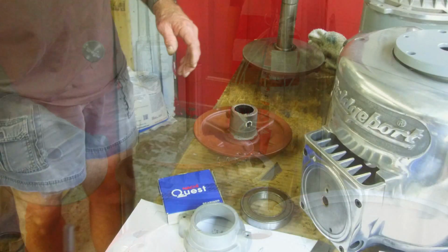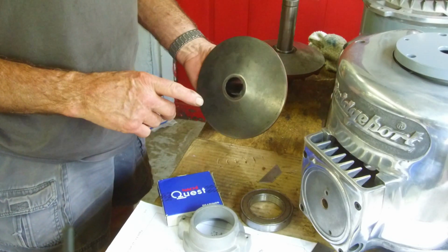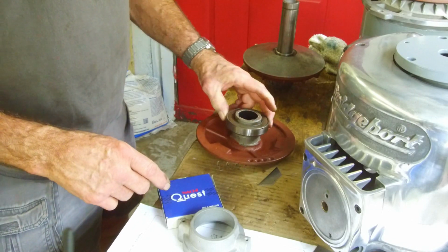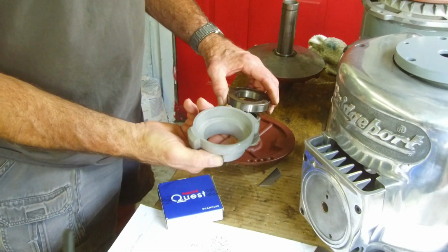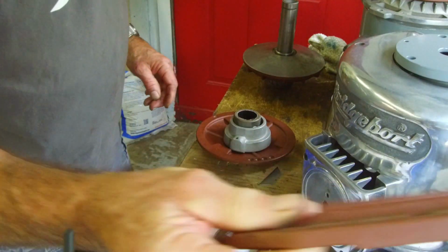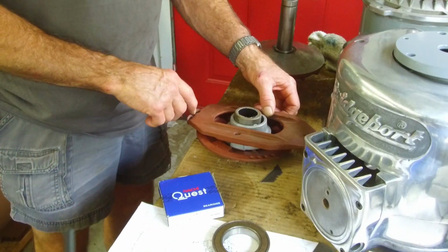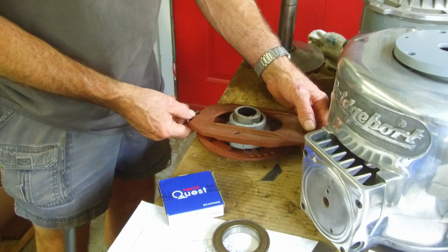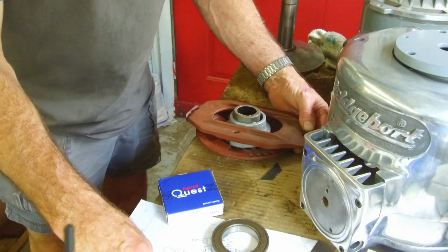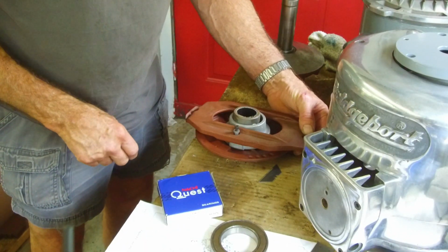off. All right, there's a few things that we need to assemble onto each of these sliding halves of the pulley system. And this gets a bearing that goes down on that register. And then this is the carrier for the bearing. And the top spring-loaded plate, or a crank plate, anchors on this end here, but it has a draw chain on this side here. It locates on this part here by a couple screws and a couple shouldered pieces there.